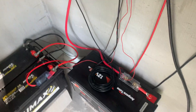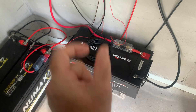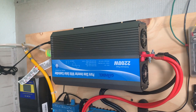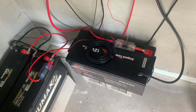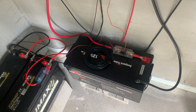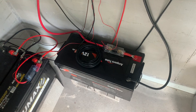I want longer run time at night, so I'm adding the two batteries. Looking back, I wish I had gone with two 100Ah so I could reduce cable costs and the amps flowing through the system with a 24-volt inverter. Ultimately, once I move this whole setup to the boat, I'm going to want 48 volts, and with a 48-to-12-volt step-down I'll be able to support the 12-volt system on the boat and charge it using my Orion.